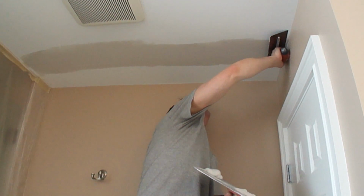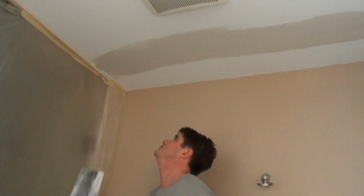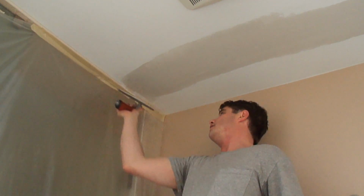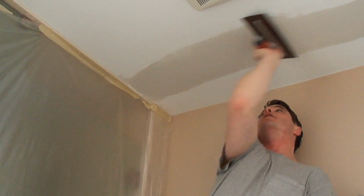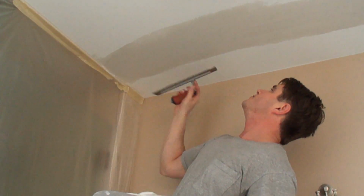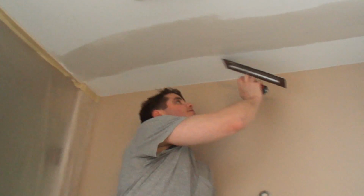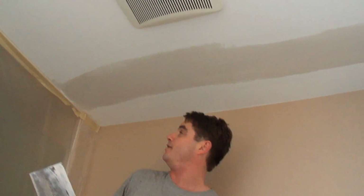Now I'm just going to skim tight. And that's what comes off there. Same thing in the corner here. I'm going to come down, grab some mud, work it into the corner and give it a little jiggle. Come across like that. Now, if you have any rough edge lines here, you can just take those away like that, so that there aren't any there. This looks fine. There's a little bit here, so like that. That's no big deal.